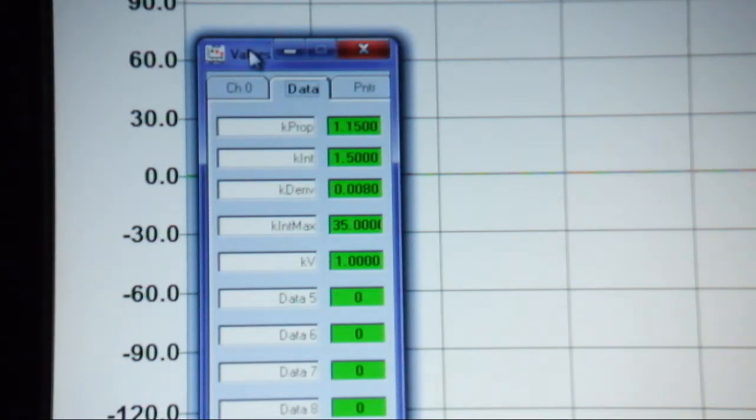Right now I have it pretty much dialed in so that 100% PWM on the motors shows up around 100 on the values for the velocity. So right now it's about 1 to 1. Under a really heavy load it should definitely change. The 100% PWM values for the motors is going to show up more like maybe 80 on the velocity, so that can get changed.